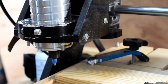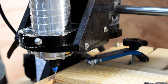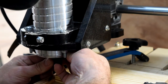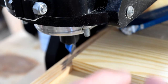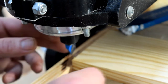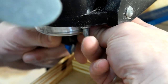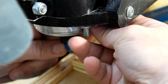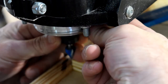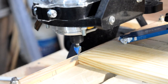Put it down and go. Bring it down just a little bit. Line up your X and Y. Loosen your bit up a little bit. Find your X and Y. Get it up just a little bit — about a quarter to a half inch. Make sure your bit's all the way up. Loosen it, drop it to the top of the board, then tighten it back up. And as you can see, your Z axis is perfect.